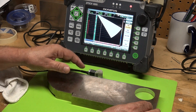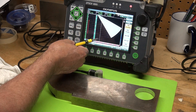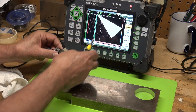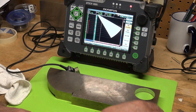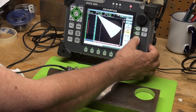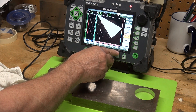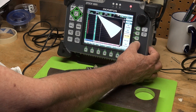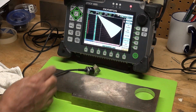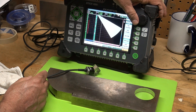This calibration is going to be basically a three-part calibration. This line here is the front of my wedge — on your sectorial scan you can set it up so there's a cursor showing the front of the wedge. Coming down to the phased array calibration menu, there's a five-megahertz transducer and filtering from 1.5 to 8.5 megahertz. Under calibration P7, pressing rotate shows: Cal Gain, Cal Velocity, and Cal Zero. I'm going to start by doing Cal Velocity.